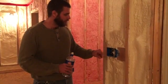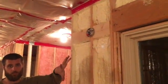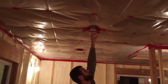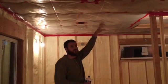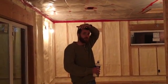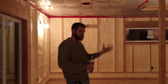The way it's wired, we have a three gang box here. We have a switch for the wall sconces upstairs — no ceiling lights in this room, so we've got four sconces in this room. Then it's a triple gang box over there, so the other two slots are for a switch for a fan light and a fan controller so we can have a ceiling fan mounted here — probably a flush ceiling type since these ceilings will be about eight feet tall when we're all done.